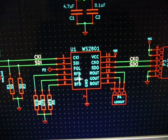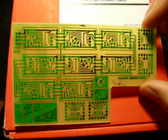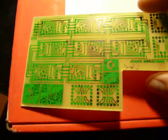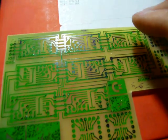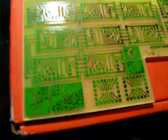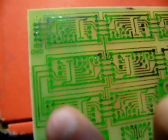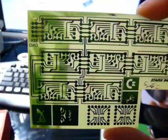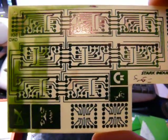So I would call it my favorite chip of at least the week. Here is the etched board for the WS2801 breakouts that I made. The green isn't copper oxide — don't worry, it's just the TRF stuff I use. You do toner transfer on here and then put this on top so it fills in the gaps left by the toner. I've interconnected all of this — you can see interconnect lines supplying power and data to all the instances of this board so I'll be able to hook it up and test it all out as it will be in the final application.